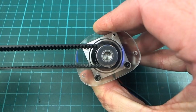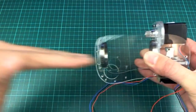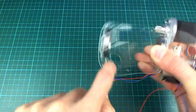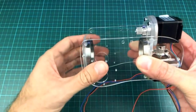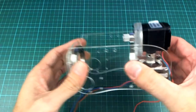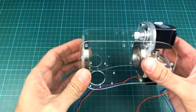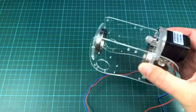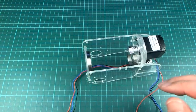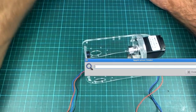2 straight lines like that. So the total weight for this upper arm section, or lower arm is it? Well, the point from this bearing, where it swivels on there, down to the gripper, it looks like it's going to be about 550 grams, which I think it was 500 grams with the last version. So I've added 50 grams to it with this version, which is not that great. It's sort of getting to the point where we're bumping up against the edge of the limit of that test that we did. So hang on a minute.